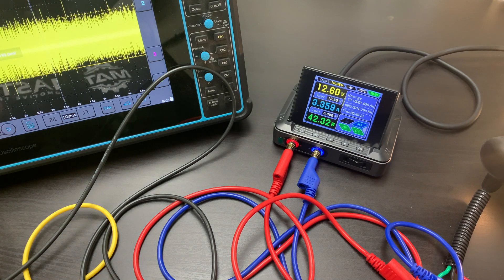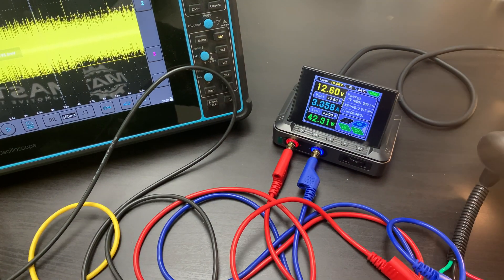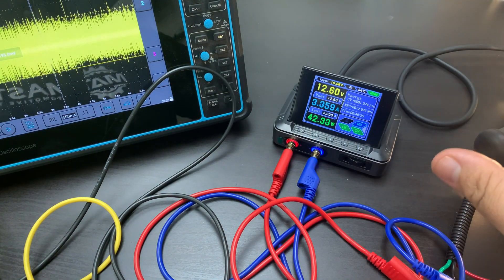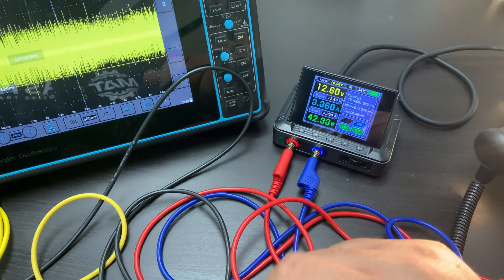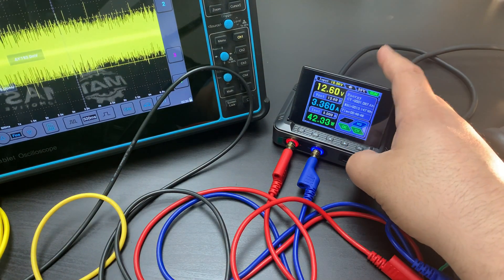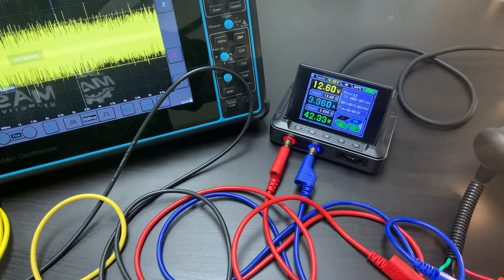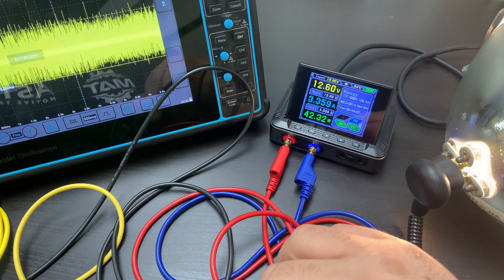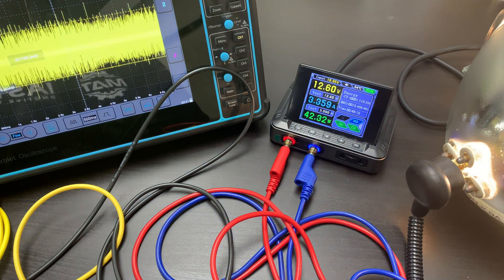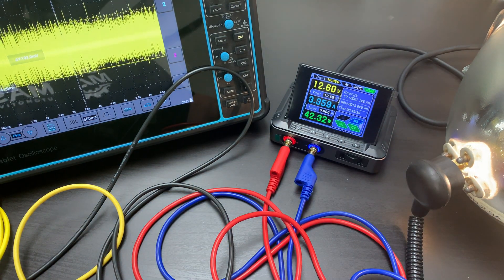So what I did here is — obviously when we were looking at it with no load, we were getting about 60-some-odd millivolts of AC ripple. What I did now is I'm running my sealed beam and using my lab scope connected to the sealed beam itself. And what we're seeing right now is 193 millivolts of AC ripple. Now, what is that telling us? This power supply might be lacking some of the internal capacitance to absorb some of that AC ripple once we have a load on it. The load we have on right now is drawing 3.3 amps — remember this power supply has a 5-amp max. In the automotive industry for most of our stuff, it's 200 millivolts AC ripple or less. For right now, 193 millivolts AC ripple is pretty significant.